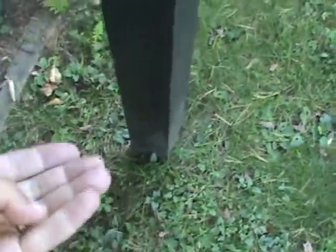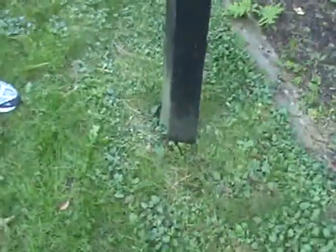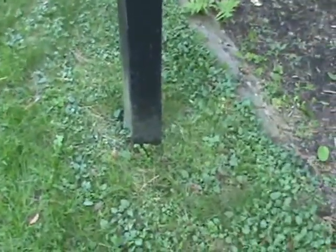I need you to clean up, open up these feet, hit the cement down below, then wrap a sonotube around it and come 6 to 8 inches above grade. And if possible, tar the feet prior to putting cement around this so that the grass doesn't go right onto the cement. Let's take a look at right there.